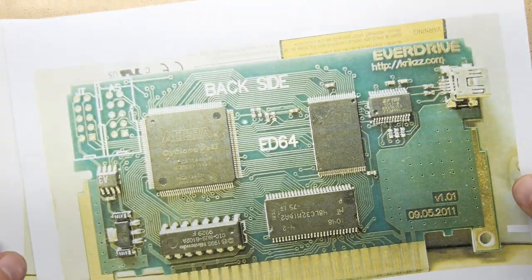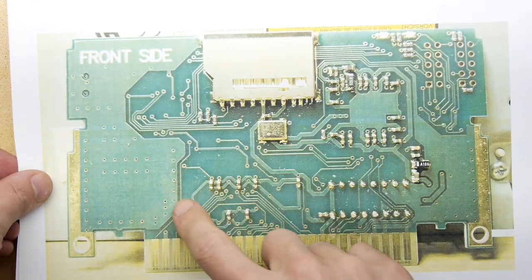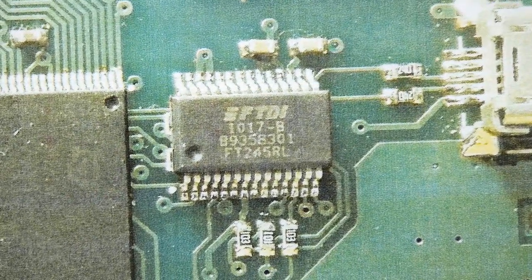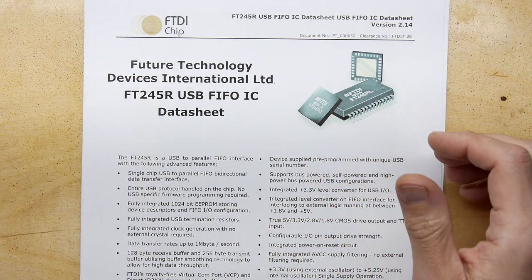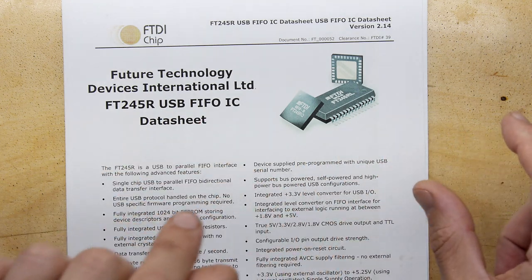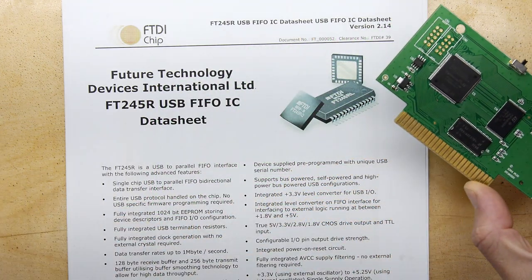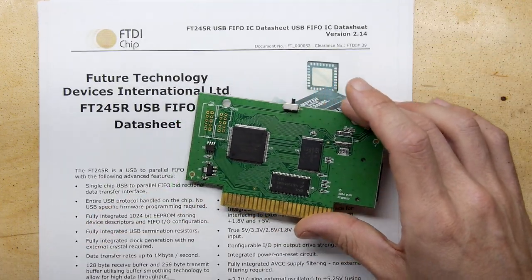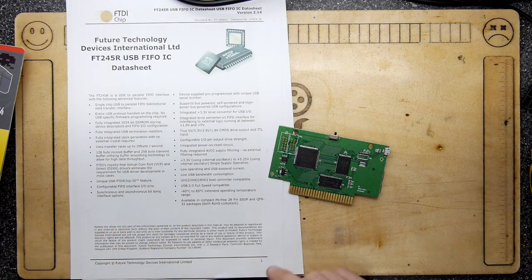After a bit of digging online, this looks very similar to the official version — they've gone pretty close to the design and just copied it. I think this would be classed as a V2.5 board. That chip is an FT245R. If you've used the FTDI232R, which is USB to serial, this is a USB to parallel interface chip that would allow your PC to see this as a parallel device and communicate with the FPGA. It almost seems rude to put it back without populating that chip, seeing as all the passives are there.